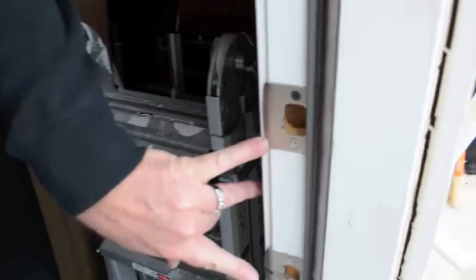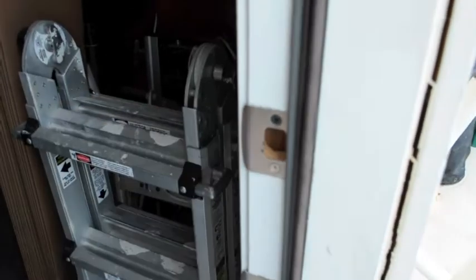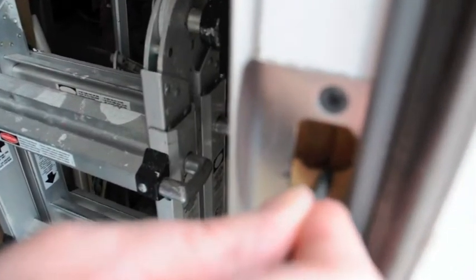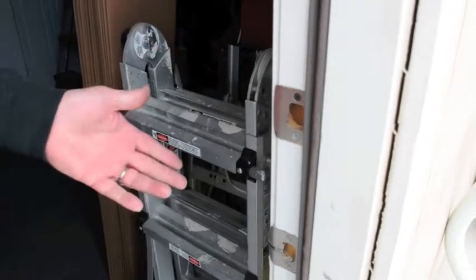If you haven't already taken care of this, the first thing you should do when you move into a new home is open each door that goes to the outside. And these are called striker plates, and you've got one or two. If you've got a deadbolt, you've got two. What I want you to see is inside this hole, you can actually see the edge of the door frame. That's all there is, 3/4 of an inch. That's all that's holding your door hardware in place.